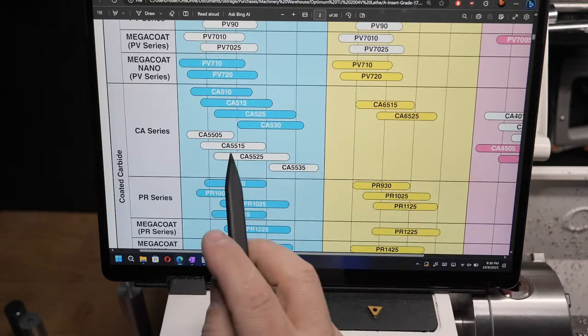You'll often see SFM, which is surface feet per minute. If you're metric, you might need to convert that to meters per minute. But here in the Optimum manual, they've already got this. So looking at this chart, let's say I'm going to cut this kind of steel. Which one of these am I using? Well, I know HSS is high speed steel, but we're using inserts. So we're somewhere over here.